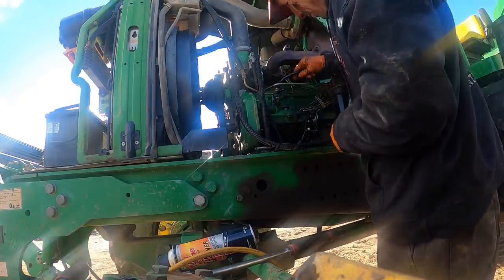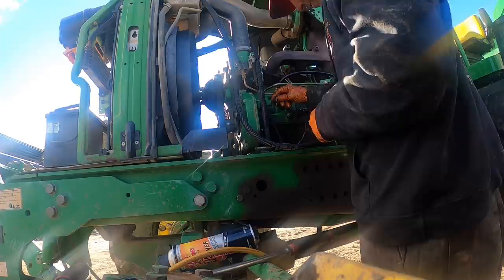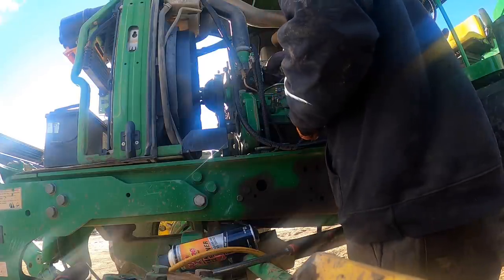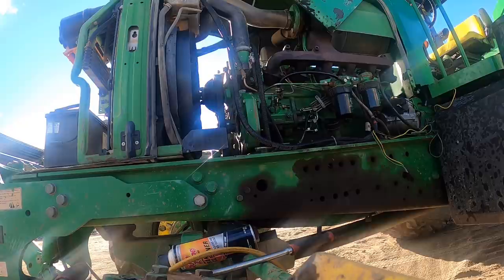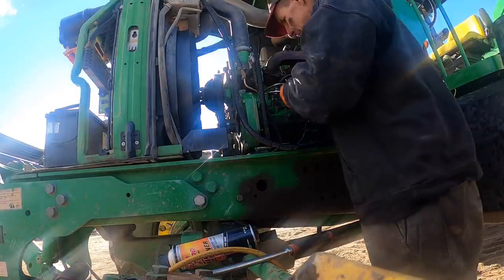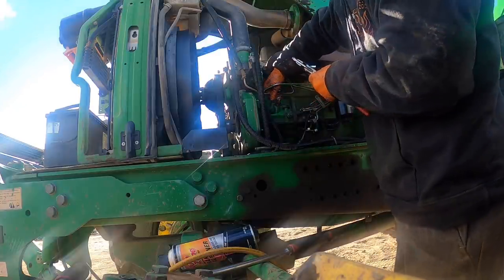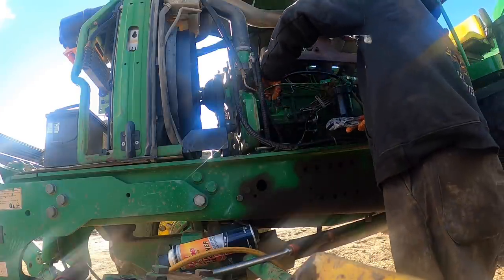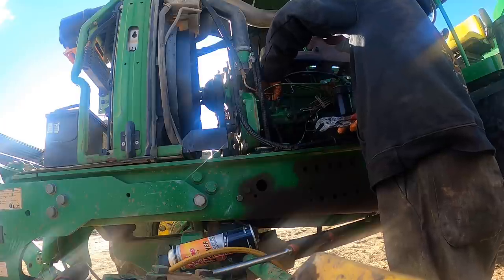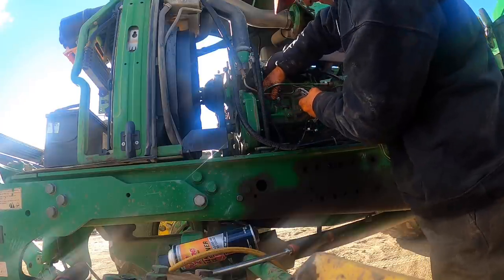So that thing sat outside there and shrunk up in the cold weather. When I got there this morning, I saw the oil. It's got a bunch of just regular hose clamps on it. They're double clamped, two clamps per nipple. I ended up having to take half the side panels and all that stuff off this morning to tighten those clamps up. We have to go back tomorrow morning and make sure there's no leaks. Other than that, once I get the hub cover back on there, he doesn't need the machine till next spring, is what he told me, but I want to get it done for him. I've got a pile of money into parts into that thing, so I want to get that done and get him billed out and get the money coming in.